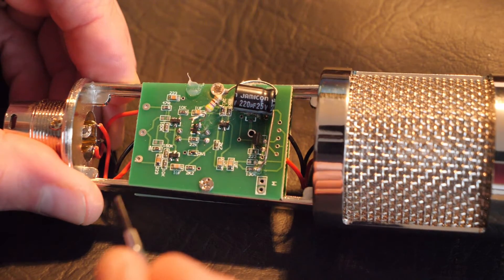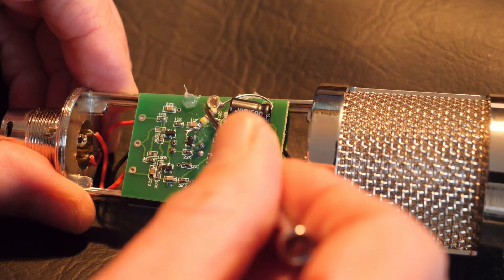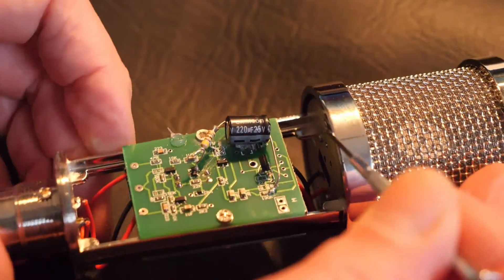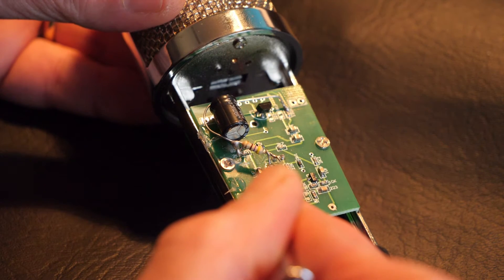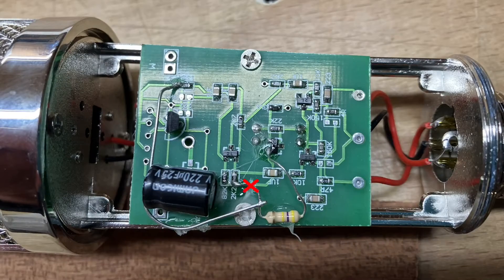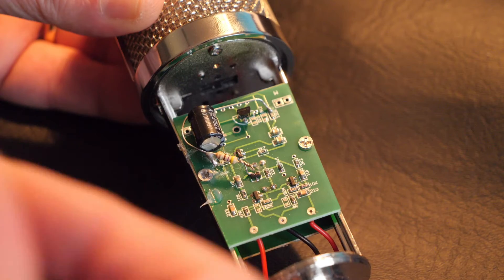Now let's have a close-up look at this hack. I'll be perfectly honest with you - this bodge here is because I put the wrong resistor in first off. What I did originally was connect this end of the resistor to this output from the transistor here. The hack involves breaking the connection from this output from the transistor through to a resistor just there - you need to break this track. The gentleman on the video had actually just soldered the resistor across the gap, but these traces are very delicate and they pull off really easily, and then you're in all sorts of trouble.